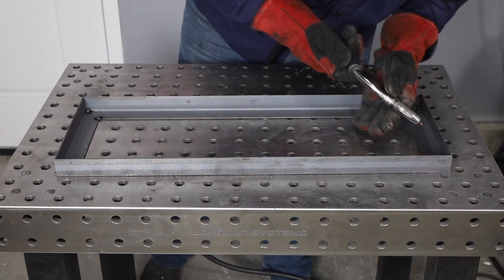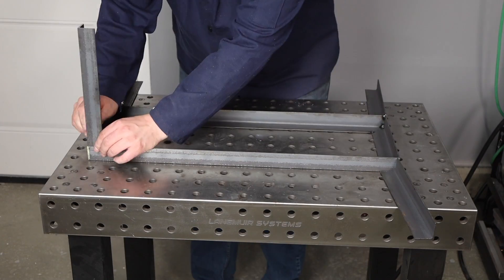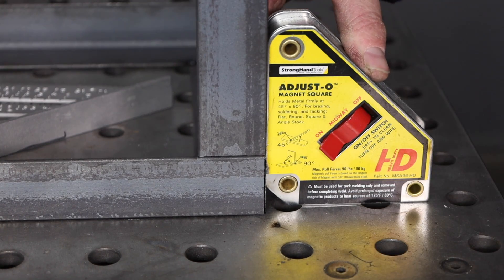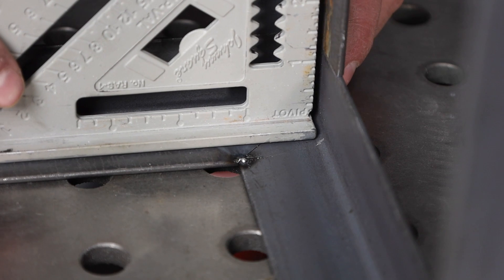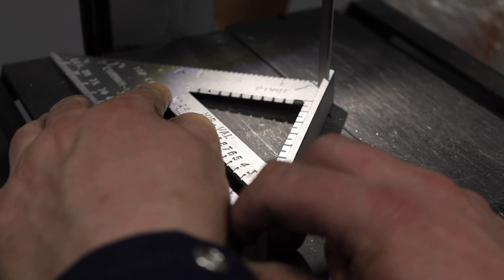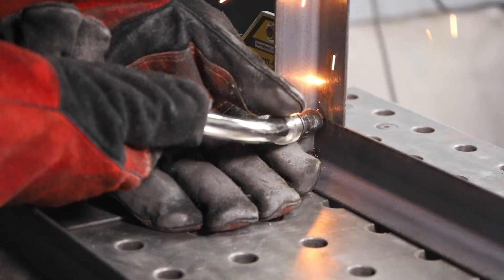Now I need to work on my legs. The corners of this frame — I'll set each of these pieces on the corner and make sure everything's looking right. I need to position it so that it's square in two directions. For one direction I'm going to use this switchable magnetic square — I really like these to hold things in place — and then the other direction I'll just line it up with a speed square. The problem is there's a fillet radius down inside the angle iron, so I can't fit it up tight. A good tool to have around is just a cheap speed square that you cut the inside corner off for things like this.